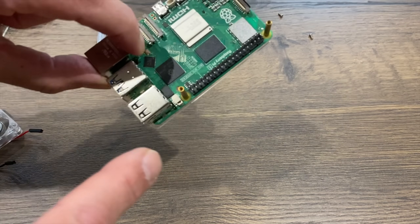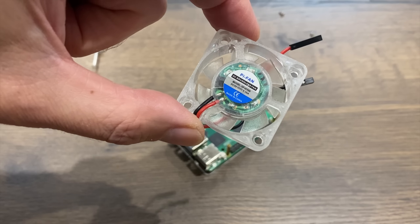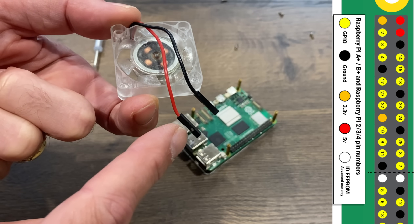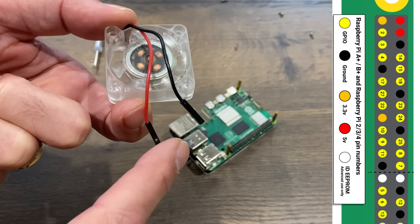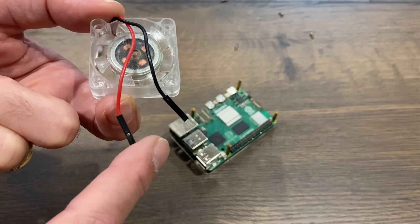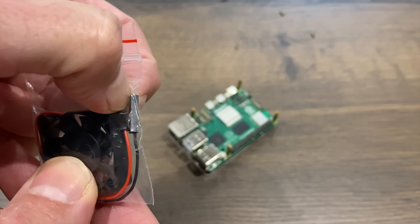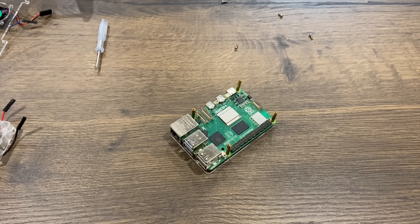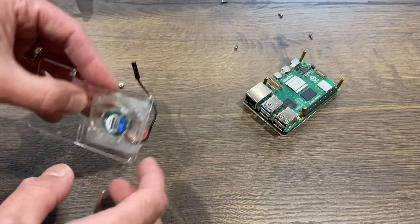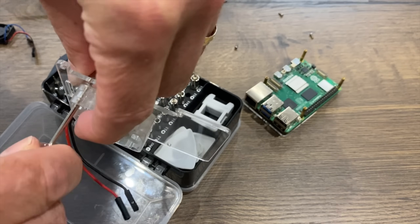Since config.txt no longer has the automatic adjustment for a PWM fan — it used to be a setting you just turned on and off — it's now going to be the official types of fans that are supported. So I'm going to wait until I get one of those, and for now I'll use a fan that's slightly bigger and quieter, with separate cables so I can have it plugged into 3V or 5V. Three volts will be quieter, 5V will run faster and be noisier but not too bad — useful for more extreme tasks like AI video processing.